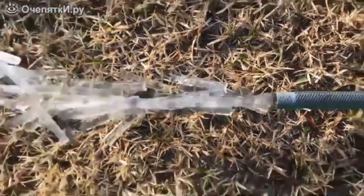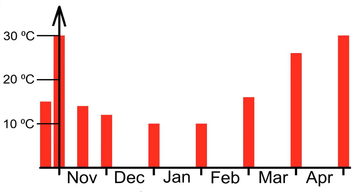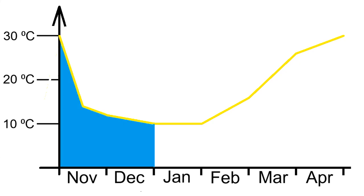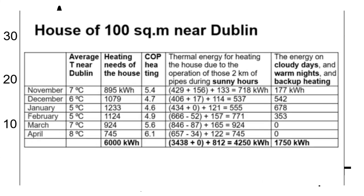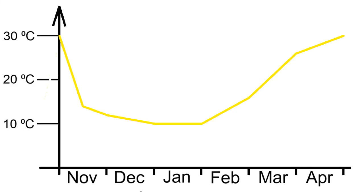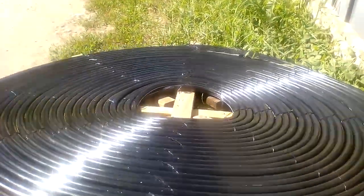Downtimes due to water freezing in the two kilometers of pipes have already been accounted for in how much heat is produced by the solar collectors during sunny hours. The average temperature of those 7.5 cubic meters of water decreases in December and November, so the tank gives additional thermal energy to the heat pump; but from February to April the tank takes useful energy as its average temperature increases. These numbers represent the electrical component of the heat pump, which converts solar heat with a certain efficiency. The Irish project is not my recommendation, as it has a lot of room for improvement — it was just an attempt to see what results these primitive solar collectors could produce.